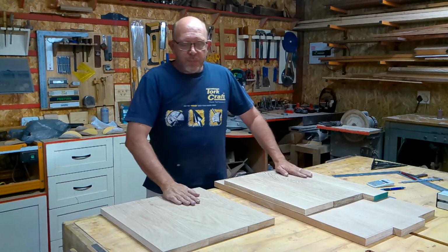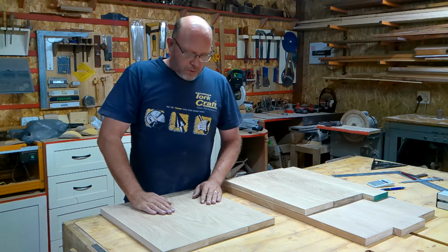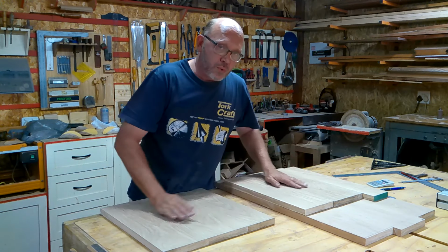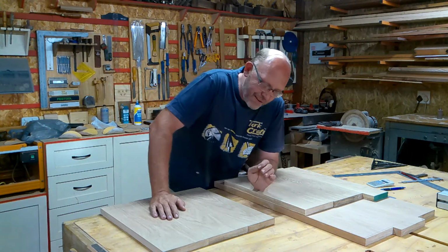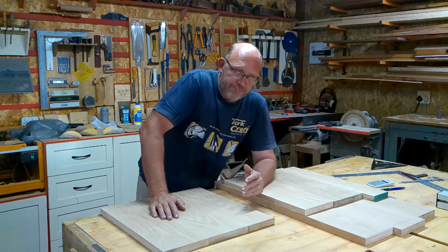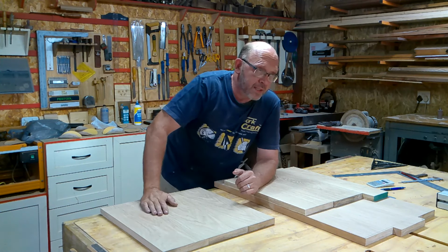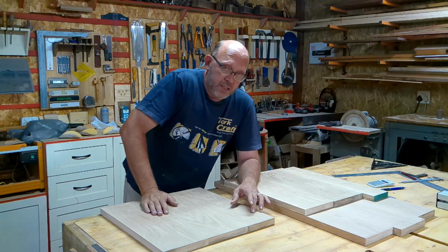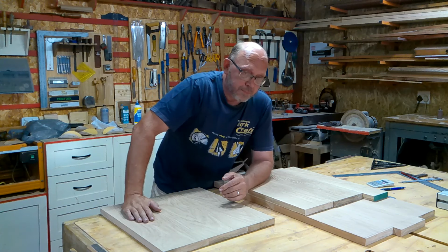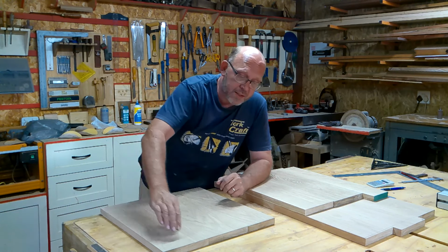So I've got them out of the clamps, and the glue line is on top. I've cut all of the parts 450 millimeters wide, because that's my fixed dimension that I know they have to be. And because the ottoman is 430 mm high and 700 mm wide, I made this 435 millimeters and 710 millimeters inside diameter that this is going to be. So I must now cut them to length, all of this.